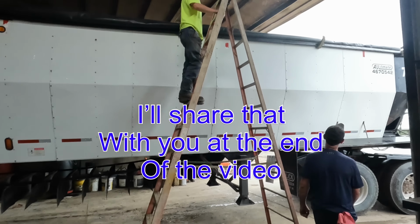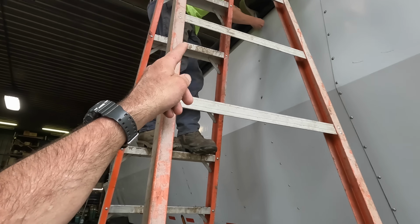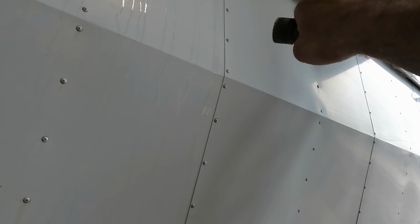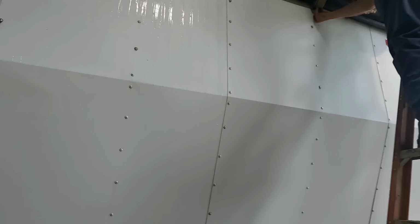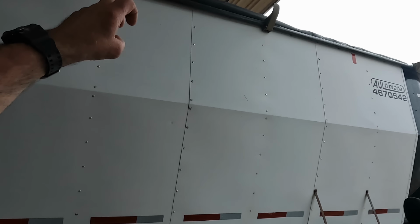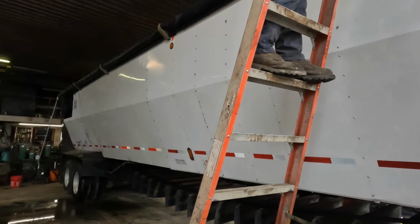Okay. All right, so what you have to do is pull the pin on the top side of those saddles, Davey. The top, you take the top pin out first. So take that top one out, it'll hinge down, and then the bottom one pinches the bottom rod in. And then we'll want to have baling twine, we'll tie that all up with baling twine so that we can take it all off as one.